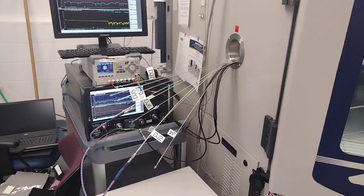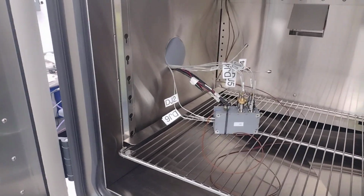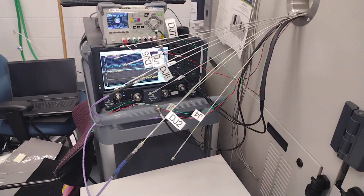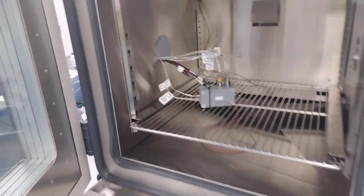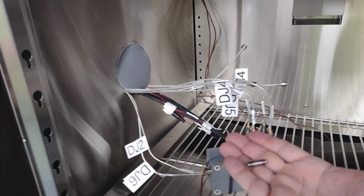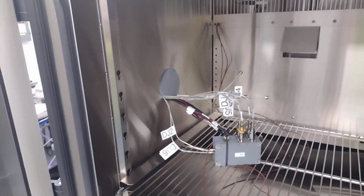This is complicated by the fact that some of the cables are outside of the oven. Some of them are inside. Those are 3-foot cables. There's approximately 1 foot in the oven. They're all pretty close to the same length outside of the oven. So we're just going to pick a pair of them and then do a calibration over temperature. The calibration over temperature, sorry to get you dizzy here, is to go in here, pick 2 of them, put that bullet in between, measure it over temperature, give it a nice soak so it stays at the temperature.